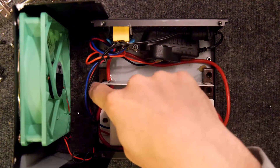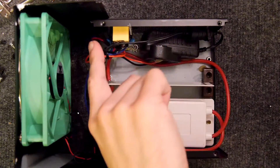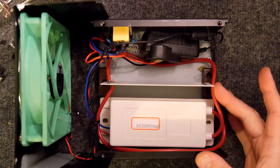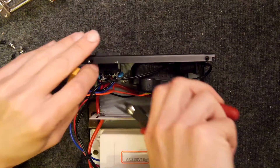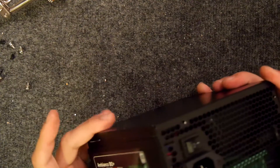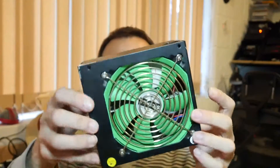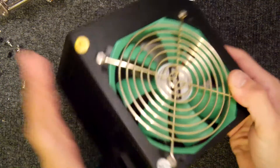The glue's dry now. I've got all the pieces into the case, all the resin is set hard, and I'm going to start putting the lid back on. I've used a few cable ties — you can see those dotted around — just to keep the wires out of the way. I don't really want them getting anywhere near this element plate, so I've left quite a big gap around it. We're just going to route the cables around the edges here. This HT lead will just about fit here, and we'll just make sure we don't snag any of these loose wires as we put the lid on.